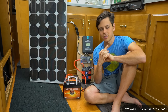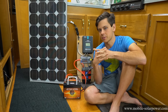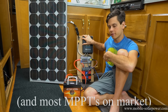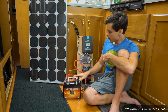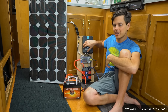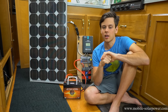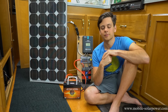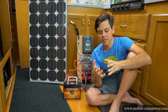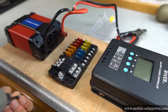Even though this is a very small and simple system you can scale it and upgrade parts very easily. Compared to a solar generator you have a lot more options for expandability. If you want to swap out for a 24 volt system, this fuse box and this MPPT works with 24 volts, so all you'd have to do is swap out the battery and the inverter — that would take minutes. Also if you go up to a 24 volt system, instead of 200 watts this thing can pull in 500 watts. I think a lot of people will love this size because it's so small, it fits in a van, everybody can build it. Let's start building it — first up is to mount all of these components to the board with some screws.